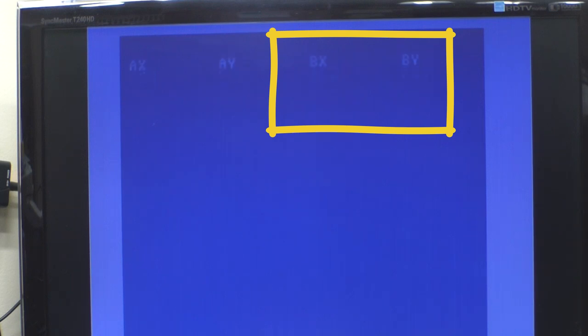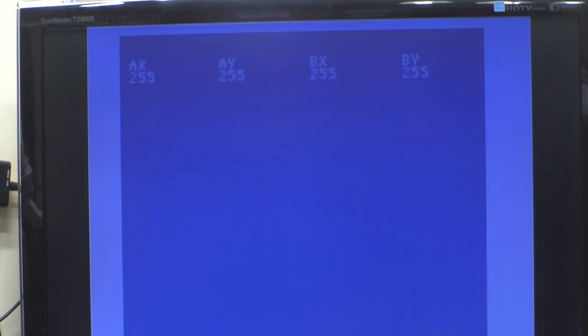Okay, this will be the BY on the screen. We're at 500K, which is essentially open. 400K, 300K, 200K, 100K, and zero. And if you've noticed the difference between the readings at each resistance setting, it is not linear. That is the way it works in 500K, which is essentially open. So, okay, so this input works. That is an artifact of how the test is done for the paddle inputs. Commodore used a very oddly sized resistor, and even though I put a resistor in the test harness that is very, very close, it can be just a little off and give you false problem readings like this, but we can test for it, so no big deal.